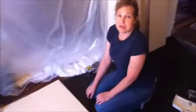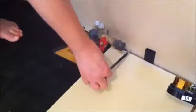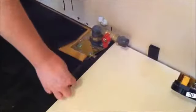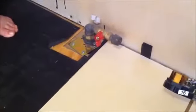The other thing that you need is the right saws. We took the pieces that need to be ripped, cut the long way, to a friend to use his table saw, because we don't have one, and we were unable to find one to rent. So the short pieces, we are cutting ourselves with a miter saw. Now we have to get around the gas line here, so because, again, we cannot tilt up, we're going to notch this out right here so that it gets around this gas line. And then we'll be able to tilt it and set it into place.